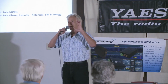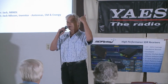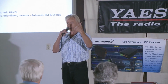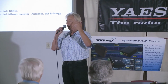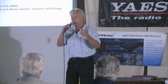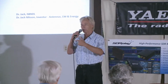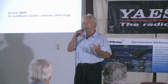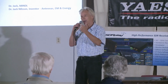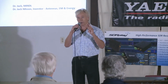Let me just tell you in a nutshell how it's different. Number one, substantially reduce the losses that you have with matching networks of standard antenna technology. Number two, when you shrink the antenna, don't just have a so-so electric field and virtually no magnetic field, or a so-so magnetic field and virtually no electric field, like small loops. Have a substantial, both electric and magnetic near field in a small antenna. And number three, incorporate diversity gain.